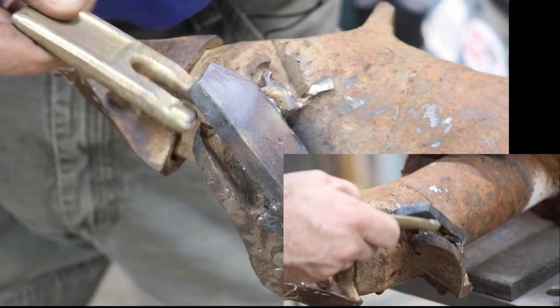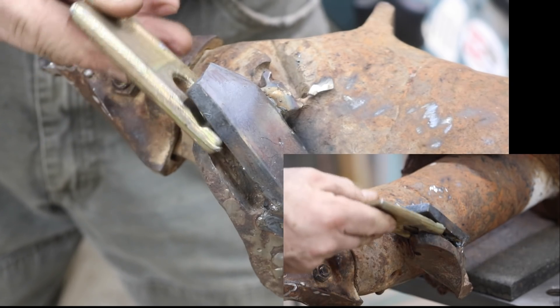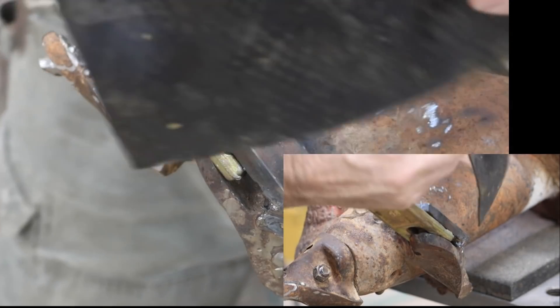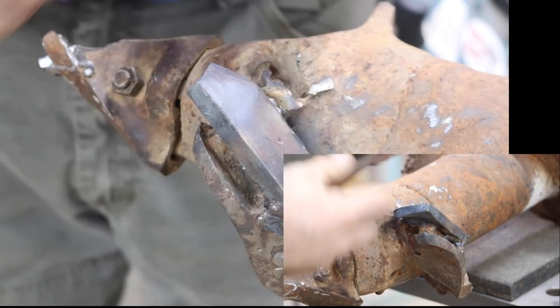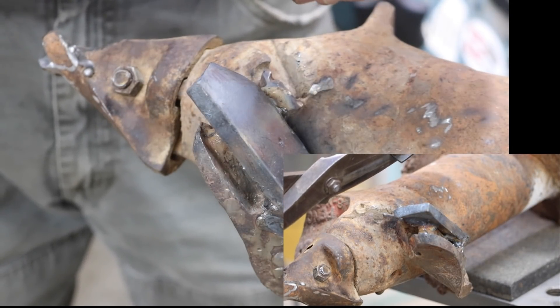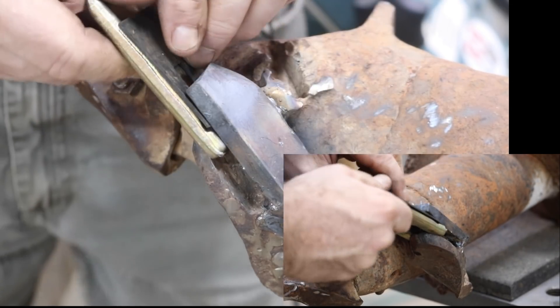We're going to put the teeth in. Put them this way — this is kind of the cutting edge. These are heat-treated forged teeth, so they should be pretty tough and pretty strong. They go in there. This gap is not an eighth, it's not a sixteenth, it's somewhere in between. A little piece of rubber — we're going to cut a piece of that. These are actually fitting fairly tight, so I don't know if the rubber is even going to fit really. If I just pounded that in there, it'd be snug. We'll see if I can get some rubber in there.